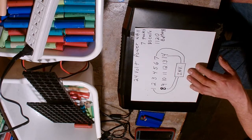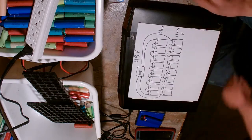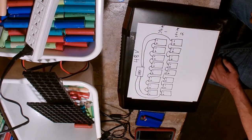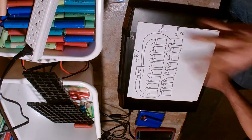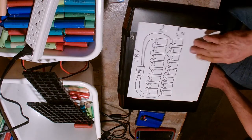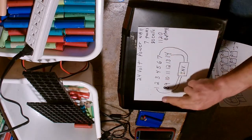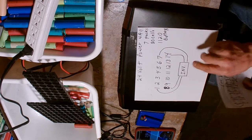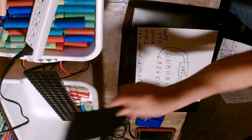Living off-grid for 10 years, if my current lead acid batteries had been in a 24 volt system, I would have had four batteries taking strain instead of two - making it a more balanced system requiring less water maintenance. The best road is a 24 volt system: seven packs in a string, pack 1 and pack 7 are your leads, giving a better chance of longer battery life with better balance and less heat.